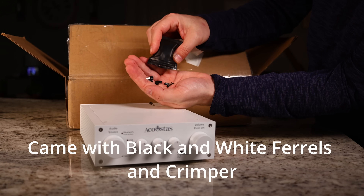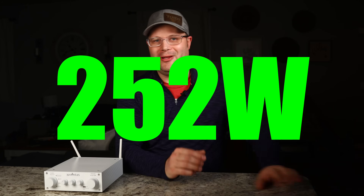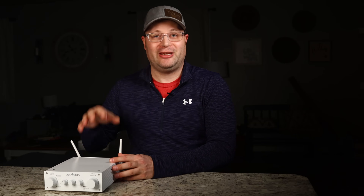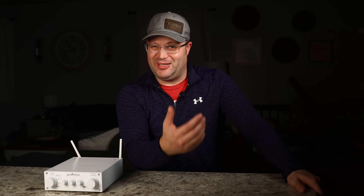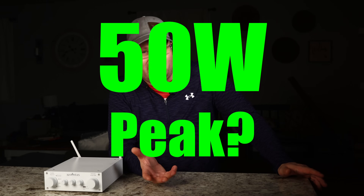This is called the AC650 because it offers six powered outputs at 50 watts per channel. Sort of. If you want the cheapest amplifier, it comes with a 252-watt power supply. However, if you want the best sound quality, you select the cleaner, more expensive power supply — though it's limited to only 200 watts continuous. So in the end, either power supply is really only going to get you between 30 and 35 watts of continuous power. That's a far cry from the 50 watts you thought you were getting, although it could hit that at peak.